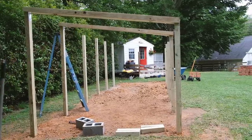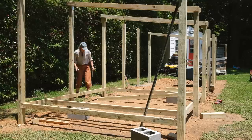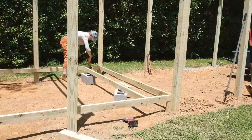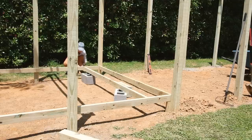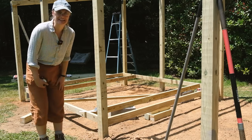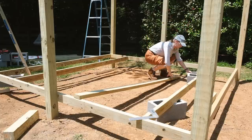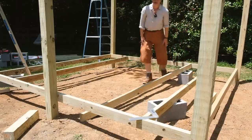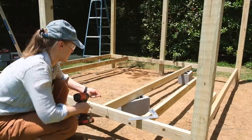This is the angle and this is how it will be constructed, with one two-by-four on each side. Securing the joists here — and see those concrete blocks? We have seven of them altogether, and they'll be spaced apart to provide support to the flooring structure. The joists will rest on those so none of the wood contacts the ground directly. Looking at this, they're starting to take shape — it's kind of like a deck and a pergola in one. We're screwing these in right now but will also add some galvanized nails since nails are so much stronger than screws. We're also going to add more cross supports in between for additional support in that direction.